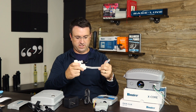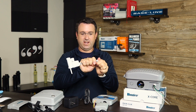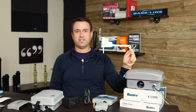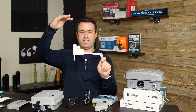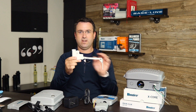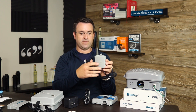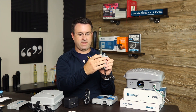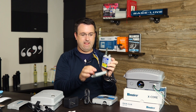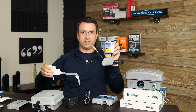This model I have here is a Hunter wireless rain sensor. This portion is the transmitter and is mounted on the gutter. You don't want to mount this in a place covered by an eave or trees, because you want it exposed to the open air so that any rain that falls can be received by the sensor. The portion that gets mounted next to the controller is called the receiver. This can be mounted indoors or outdoors — it does have a rubber cover that sits over the unit. When you first connect it up, you'll look for status lights to make sure you have a good connection between the transmitter and the receiver.